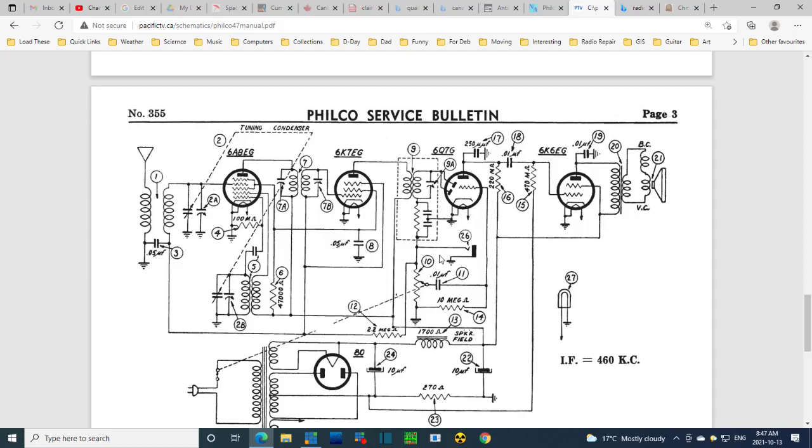After being rectified, you're getting a rectified current. We've tied the two plates together in this tube — nothing special about that. At this point you've got a rectified RF with the RF largely removed and kind of smoothed out, so we have the audio sitting here now that's been recovered by this trick of rectifying it. Lots of tricks in these radios — all radios are a big trick.